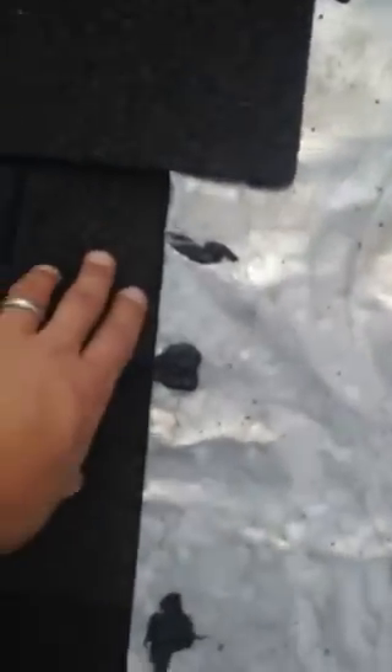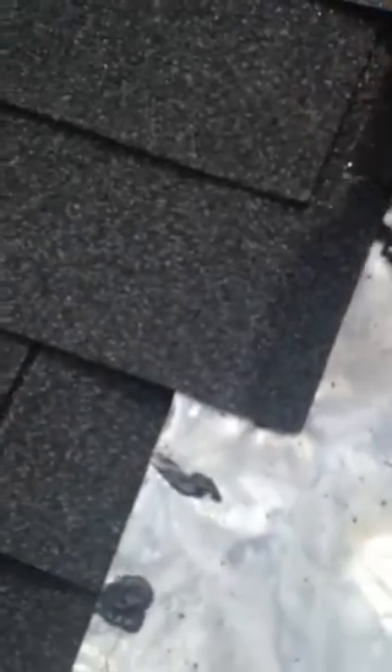This plumbing stack here is kind of weird because these couple rows of shingles should have still been running over top. Rain and stuff — it's only an inch away from getting in here, and if it gets in there, well, there's a hole cut in there. It's not really done all that well, to be honest.